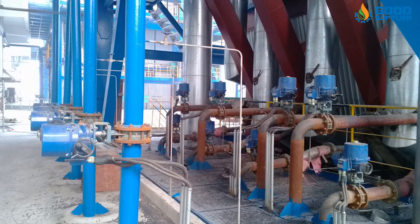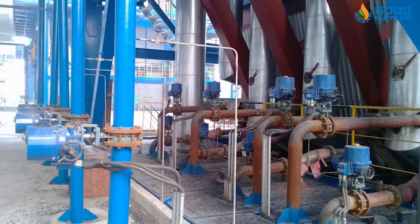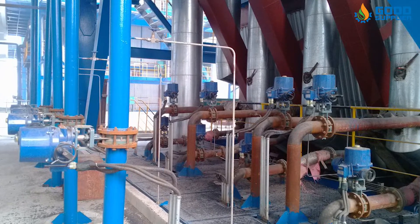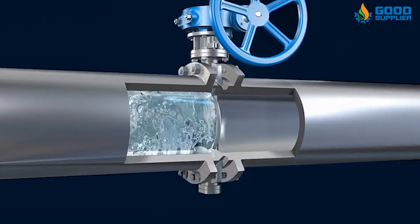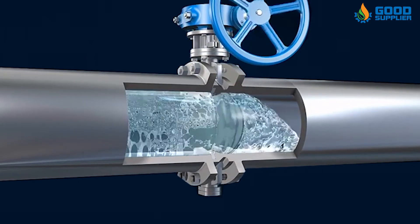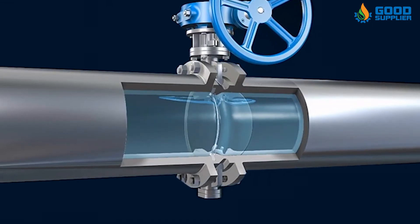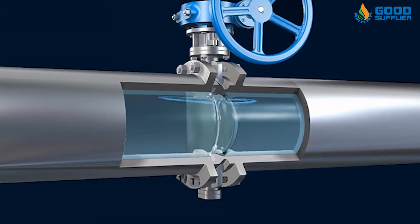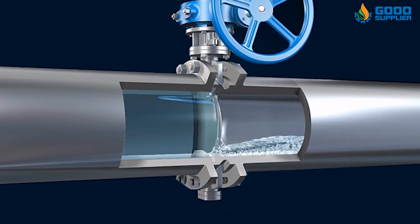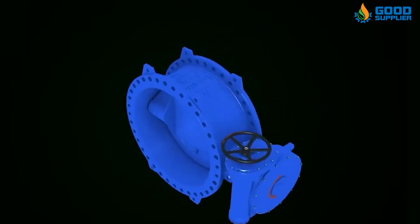From a family of valves called quarter-turn valves, the butterfly is a metal disc mounted on a rod. When the valve is closed, the disc is turned so that it completely blocks off the passageway. When the valve is fully open, the disc is rotated a quarter turn so that it allows an almost unrestricted passage of the fluid. The valve may also be opened incrementally to throttle flow.